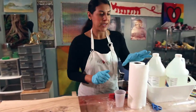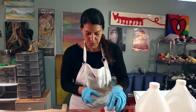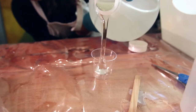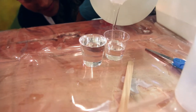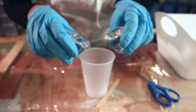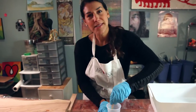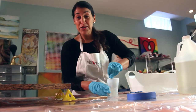So we're going to mix up our resin. Since I'm using a gloved hand for this pre-coat, we don't need a huge amount — just these little plastic glasses. I'm mixing the resin and hardener together with a popsicle stick. We've got level amounts, pouring both into a plastic cup. Stir for three minutes, making sure to scrape the bottoms and sides — we don't want any unmixed resin.